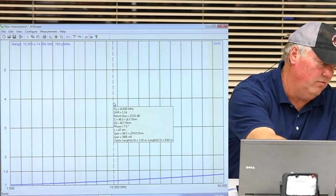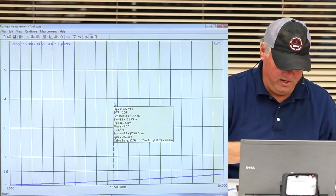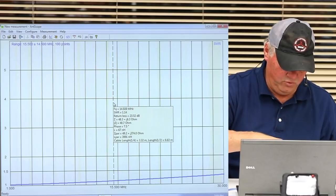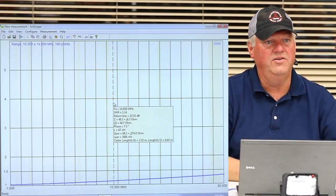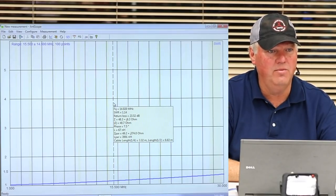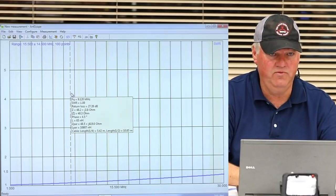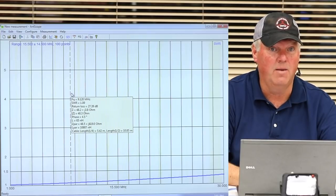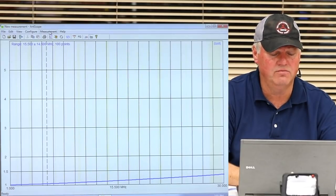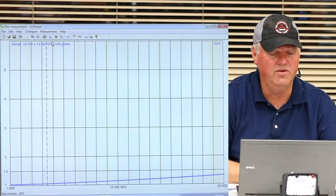So now what if my antenna isn't perfect anymore? I haven't swept it yet. I added another 100-ohm resistor. So what do you think is going to happen to my SWR? It's now 50 ohms. It's a 2-to-1 transformer, so the other side of it, my radio is going to see approximately 25. Exactly, 25. So what's that going to do to my match? What's it going to look like? It's thinking. Who knows the answer?